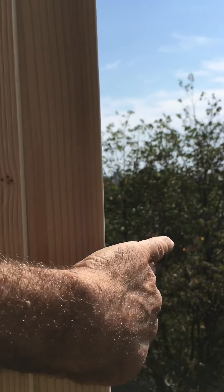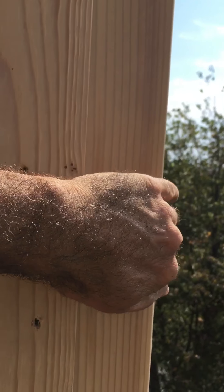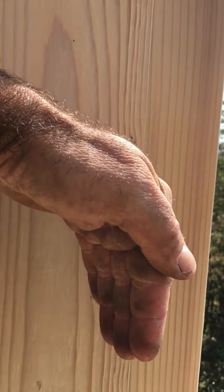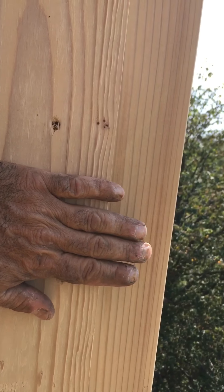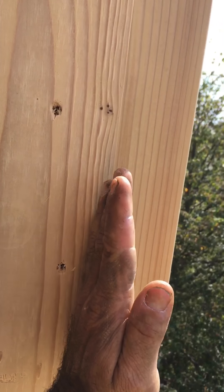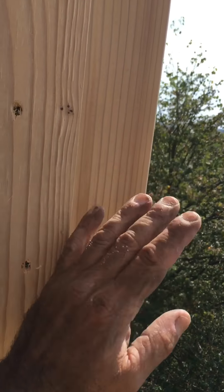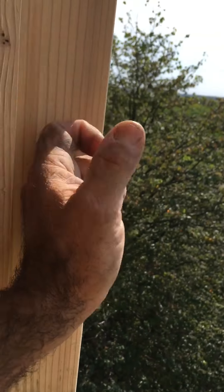It's called a thermal bridge — to stop all materials from thermal bridging. We had to do a little extra detail in the window openings. If we just framed this out and put the studding there, our window sets back inside the facade. So this looks like the windows are carved into the facade and not flat — it gives more dimension. It's pushed in, and rather than keeping the blocking out there and stopping the two-inch insulation there, it wraps in and comes right up to the window frame. So there's no thermal bridge in these areas — the insulation gets wrapped around so materials don't get the cold going through them.